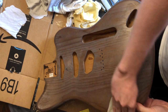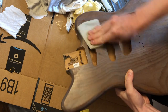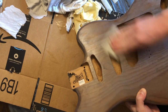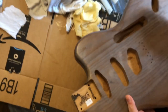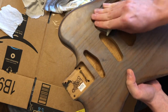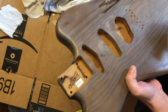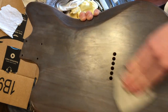After applying coats two and three, I've decided to progressively sand it with some micro mesh. I am dry sanding — I don't really do wet sanding; I don't like the idea of wet sanding and wood. I'm going to dry sand this with progressively finer grits of micro mesh. I recommend doing this before and then again after every single coating. It's probably how it's done by professionals — you do a lot of sanding when finishing guitars. It's not particularly enjoyable, but you've got to do it to get a nice even coat and shine.